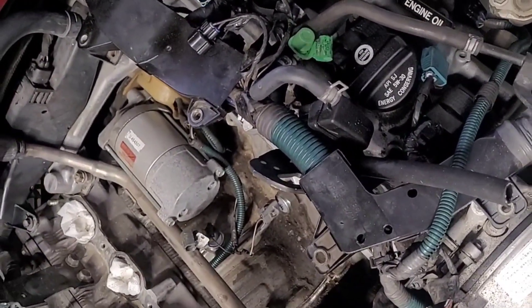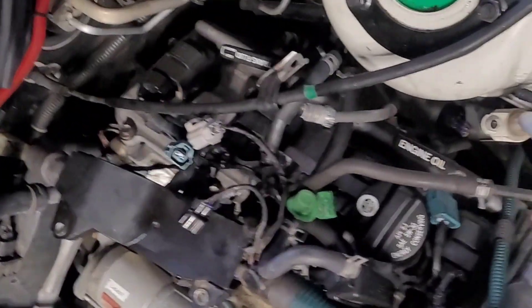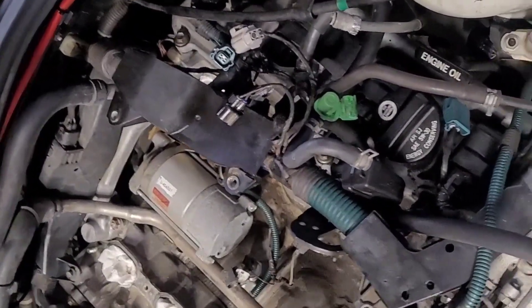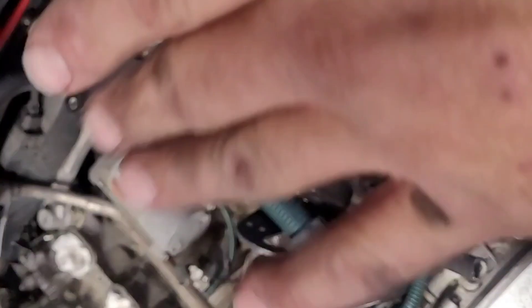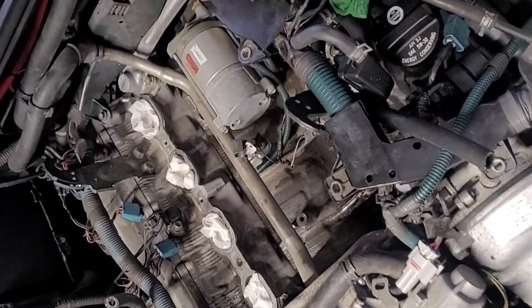'Irregularities' — that's a big word; be proud I got that out. Thanks to Gaston County school system! Anyway, let's get those out, get the intake gaskets on. The backs are studs — all four corners have studs that hold the gaskets in place. When we put that in, we won't worry about the gaskets moving, but we do want to make sure we cover any ups and downs. We already surfaced the intake as best we could using our redneck methods.